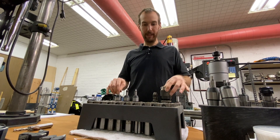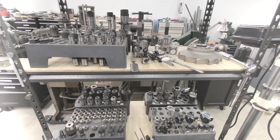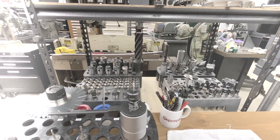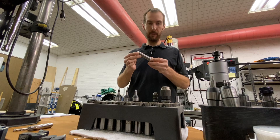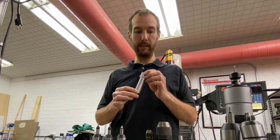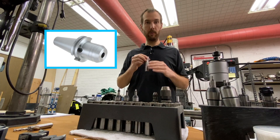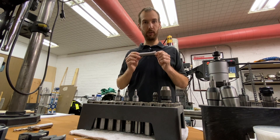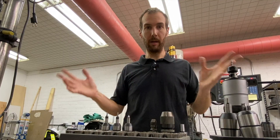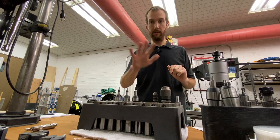Today, I wanted to share thoughts, ideas, and strategies about tooling. The R8 is a style of tooling made by the Bridgeport Machine Company in Bridgeport, Connecticut, originally made for the Bridgeport knee milling machines. To my knowledge, this is the most popular small mill collet or tool holder system in the U.S. For small machines, this is it. When you get into bigger machines, you're looking at Cat 40, Cat 50, and HSK for 5-axis. I really wanted to focus on R8 because this is what we've chosen to concentrate on in this shop. Choosing a popular style gives you the most options, and that's what I want to show today — the R8 tools, tool holders, and all the different options available.